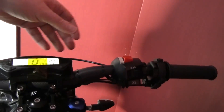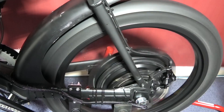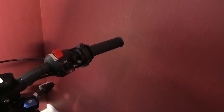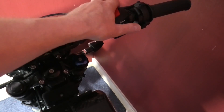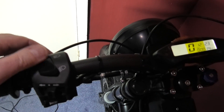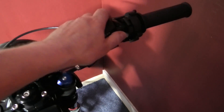Kill switch - enable. The regen I've set so it comes on with the throttle - when you let go of the throttle the regen kicks in. I'm not using the switch, I'm not using the brake switches. The brake lights are working, the indicators are all working, telltales are all working. Headlights work, side lights, headlights, main beam. Turn the headlights off, turn the side lights off and the main beam doesn't do anything. That was a challenge to get it so it doesn't do anything when the headlights are off. The flash isn't connected, everything else is.